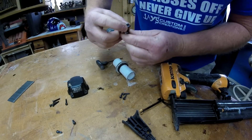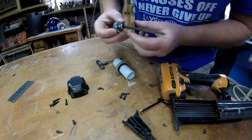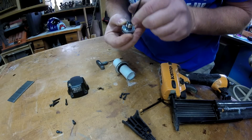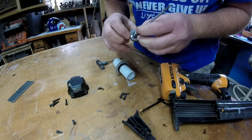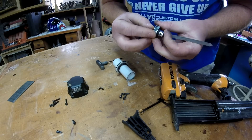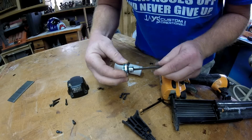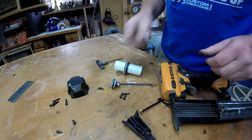Broke the seal again. Looks like my rod's bent here — it's just a little cheap aluminum piston. And this galled as hell right there, and this seal wore out and split. It's just not good. You can see how it's all catty-wompus.